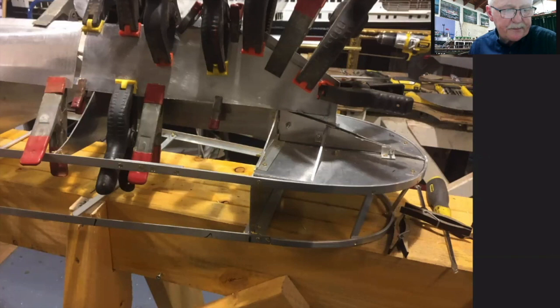So the plating is 1mm aluminium. Drilling through the plate and the frame, countersinking and bolting with 3mm brass bolts, washers and nuts, but also gluing with epoxy resin. Each plate would have 6 to 8 bolts. Plating from stern to bow, keel to deck took a while. I could see the whole thing coming together. I think there were over 100 plates of approximately 6 inches by 4, but I certainly got through more than 1,000 nuts and bolts as I had to order more to finish the job.